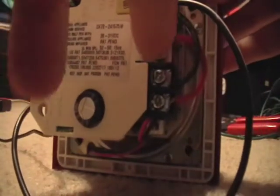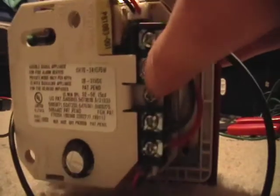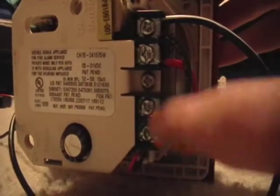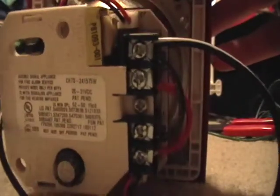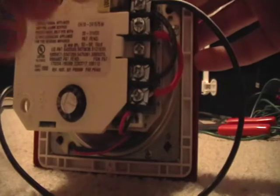So you're going to take the wire from that side and wire it to the positive. I have my CH70 wired with two wires going into the chime, and then two little wires split out and go to the strobe, so that makes it a two-wire connection. Anyway, then you're going to take that wire — the white one in this case — and wire it to the positive on your alarm.